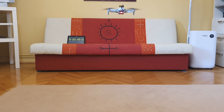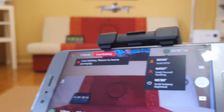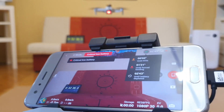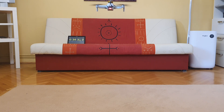Passing the 25-minute mark here. That's basically 27 minutes, if I remember correctly, the factory capacity of the battery when it was brand new — like really the second charge. The first low battery warning came at 28 and a half minutes, which is pretty cool, I think. So you see all the functions are working: even the battery temperature — not the one on top of course, but it's more prone to be cooled by the air. Critical low battery at 31:40. So even the battery temperature, all the charge warnings, the forced auto landing — this is the one which you can still keep going. So all these functions are working, really no compromise on safety measures at all.